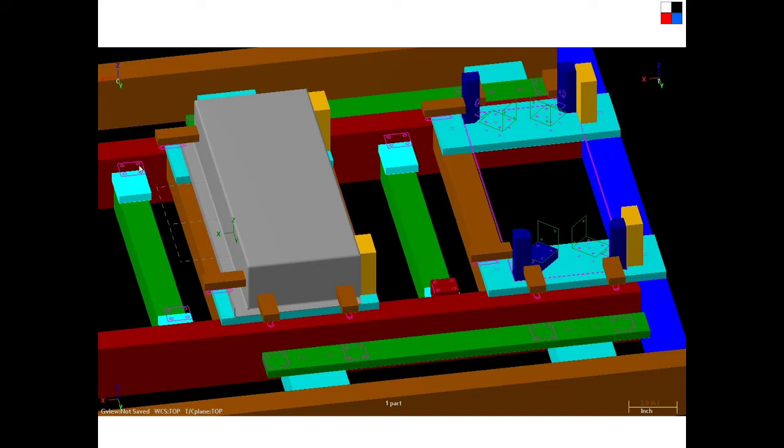But he's not drawing out all of the clamp components, and that's partially just to simplify the model so that there's less to look at, but also less for Mastercam to have to deal with. So you can see there's actually a clamp here and one here, and then on the two sides, and I guess there is not one on the back. He just has a solid bar holding it on the back, and then two solid bars on the right side that are holding it, because you can use those as locators and just clamp from the opposite side. So let me show you one of these Destaco clamps. If I hit the right button here, which, that was not it.